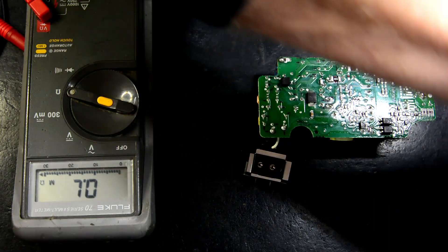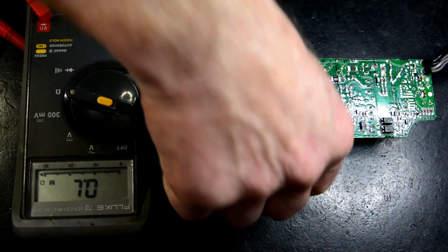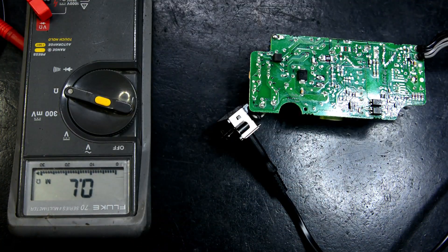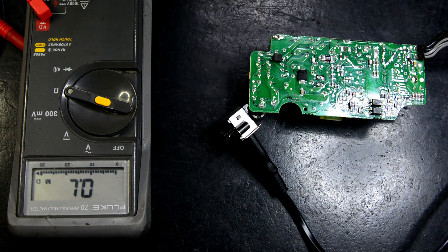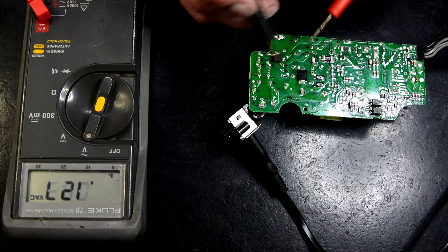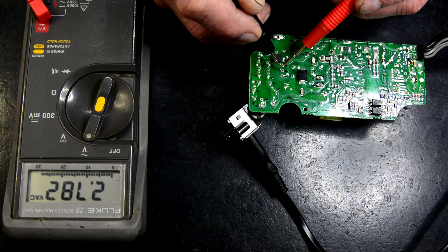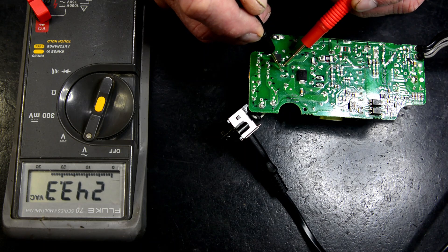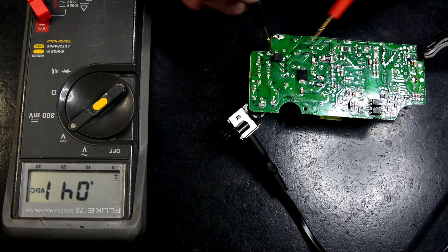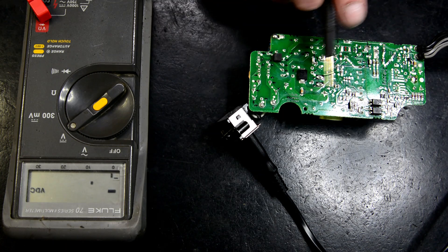Now, it's pretty dangerous — you've got to be careful, because it's 240 volts. So unless you're an electronic technician, I'd suggest you do not do this at home. It's purely for educational purposes. But basically every power supply you do will be basically the same format. So we've measured AC volts: 240 volt comes in here into the centre of this rectifier, we've got 240 volts coming in, and we have DC coming out. So already we know all that front end is okay.